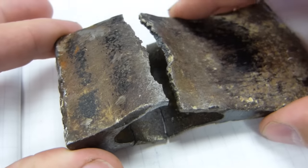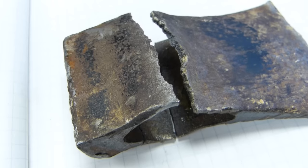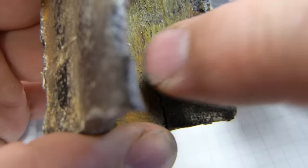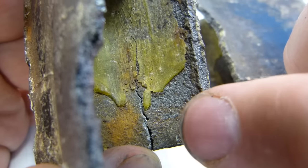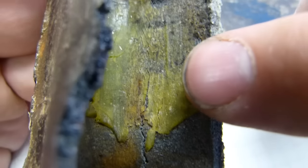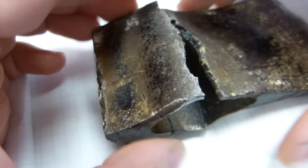Look at that - it's bent backwards. It's too ductile. Why is it too ductile? How did we end up with this product? This head was cast, not forged. The casting can be seen here on this granular surface - it was sand cast. That's the negative side of the sand mold. What you see is the grain sizes of the sand mold that made this cavity originally.